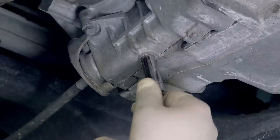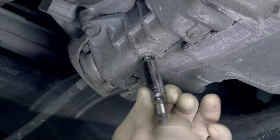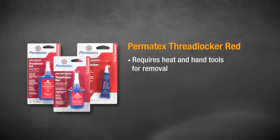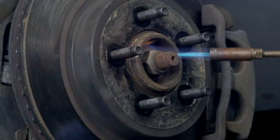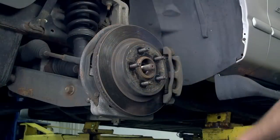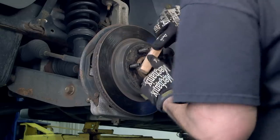When it comes to removing fasteners where Threadlocker has been used, if it's Permatex purple, blue, or green formulas, hand tools should be all that's needed. Fasteners that have been installed with our red formulas will need localized heat and hand tools for removal — the parts will need to be heated to about 500 degrees Fahrenheit. You can use a heat gun or a hand torch, but go slow and be aware of your surroundings and the dangers of working with high heat.